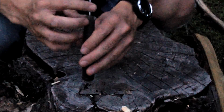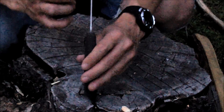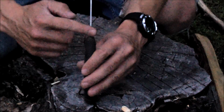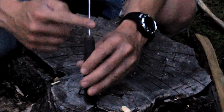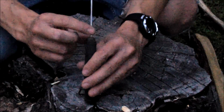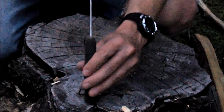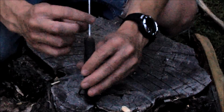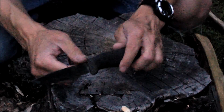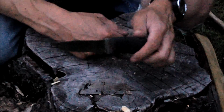One more thing, guys, Mora knives, as I mentioned before, come with rounded off spines. Other than the bushcraft black that I know of, their spines are not squared off. So they will not scrape fine shavings of wood, and they will not strike a ferro rod. They will not remove that ferro rod material until you grind that down with a mill file.